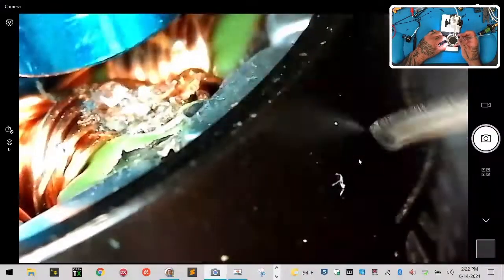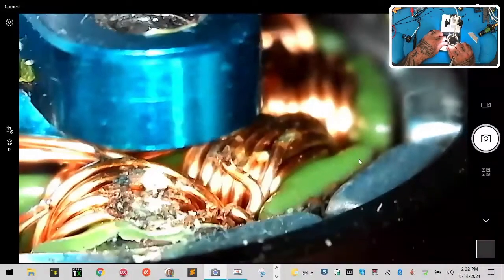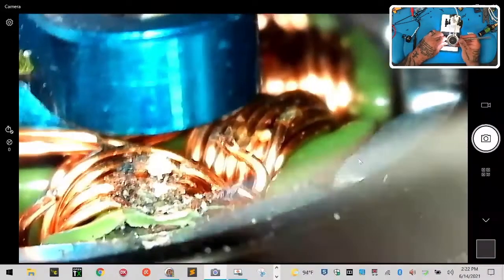If you ever are on the receiving end of this, you will have a drone that gets so hot, I mean, you could smell it burning while it's flying for the first 30 seconds. And then, will it catch on fire? Well, it'll definitely overheat. And yeah, I guess it could catch on fire. There's your other part of the broken. And again, you can see where it's all been pressed down right here, which is because the screw is too long. All right, I don't need to do much more work on this one. I will take the other 4 motors off though, so if you'll give me a second, at least this way we can verify that all of them were done this way.